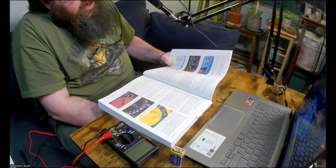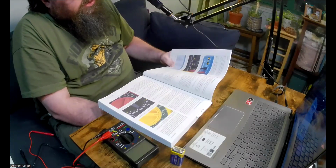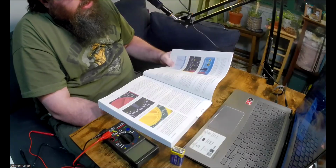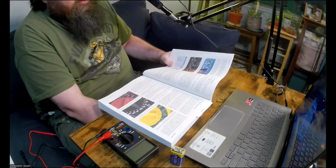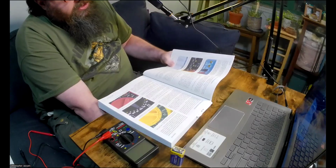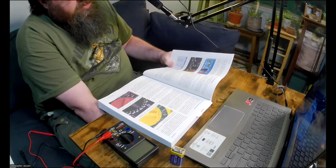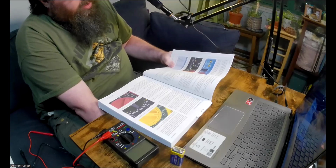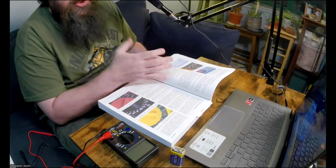We measure distance in miles or kilometers and temperature in Fahrenheit or Celsius degrees. We measure electrical resistance in ohms, which is an international unit named after George Ohm. And he has a little historical tidbit on George Ohm that we'll look at the end of experiment 1, who was an electrical pioneer. The Greek omega symbol that I showed in figure 118 represents ohms. For resistance above 999 ohms, the uppercase letter K is used, which stands for kiloohm, equivalent to 1,000 ohms. All the standard prefixes that you use for the metric system apply here.